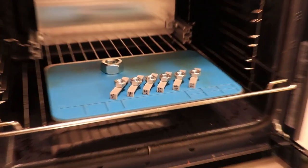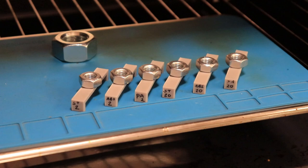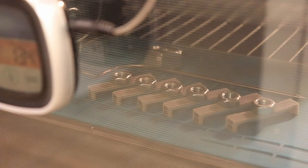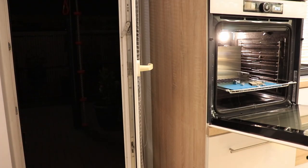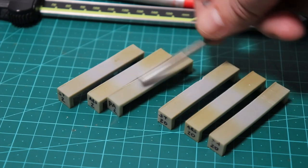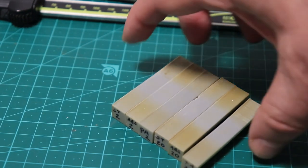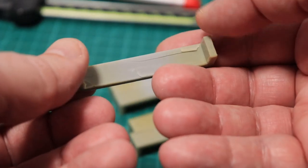Another temperature test in this oven with an M10 nut as a small load — I want to record the temperature of the starting deformation. I followed the temperature with a cooking thermometer, and it was very hard to see any difference or deformation; I went up to 240 degrees Celsius. Only when I opened the oven I noticed I had to ventilate. I couldn't record the deformation temperature, but I can see the difference in hardness. The standard resin was soft, ABS-like was softer, and PA-like was the softest in both curing versions. The 20-minute standard resin cracked in several pieces under the effect of temperature.